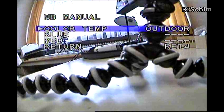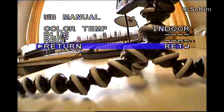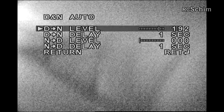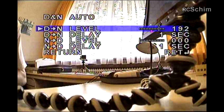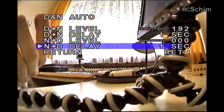White balance is really a cosmetic issue. I had it set to outdoor, which looked very bluish outside. Now I just leave it at indoor and it's okay. With image settings, you have to read what all the options are for — contrast and sharpness are okay to adjust a bit, just leave them around the middle. If the cam is in a really dark setting, it switches to black and white mode like it does now, and then it comes back. It has some delay from day to night and night to day, and you can set how fast it should switch back to color mode. It's also available in German, but I stick with English.